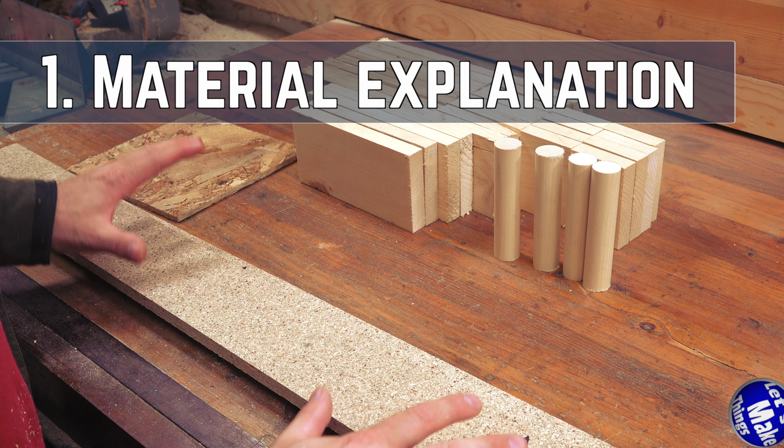All right, I've got my board here at the drill press, and I've got a board attached to the drill press with a couple clamps. I'm using a 9/64 bit because I'm going to be using a number 8 screw in each one of these. So what I want to do is drill down just partially. And now I'll stop. I'm going to lock it in place right there. And then I'm going to bring my board, which has a little mark on it, right next to that line that I made. I want to make sure that that's going to be right on there.